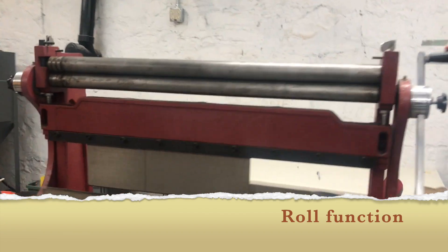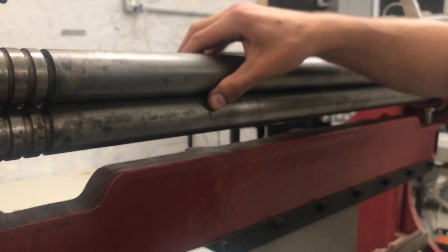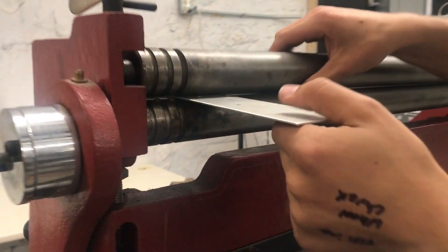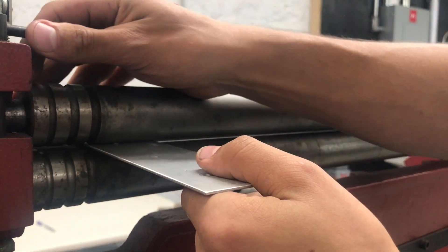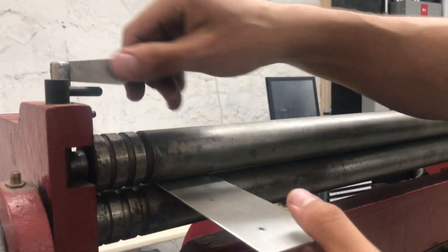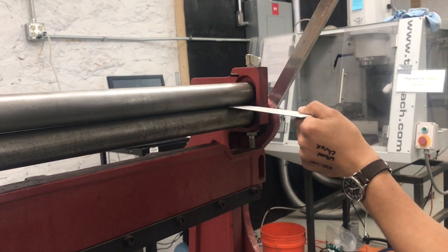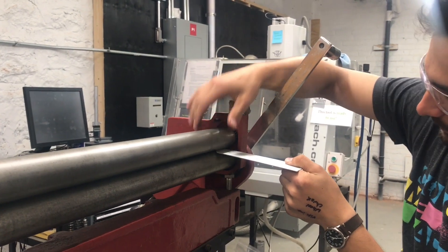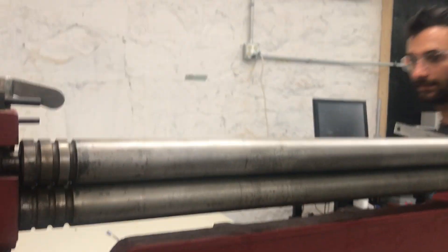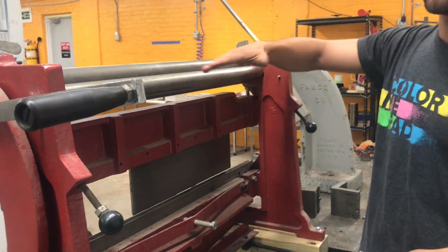I'll put the crank back to the middle. The first step is making sure that the rollers are at a good height. There are three rolls here — these two are the initial ones that hold the metal in place and feed it forwards. You want them to be pinching tightly, because if they're not pinching they won't be pulling and the metal can just slide through. We're going to tighten down on this until it's snug. On the back side you can see these two knobs — these knobs adjust the position of this roller, and this is the one that gives the radius. We're going to start by rolling these back down, and you want to make sure it's parallel. If it's not parallel, you're going to have a weird, twisted curve.